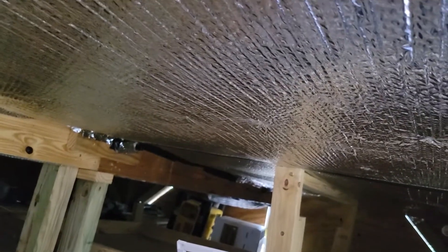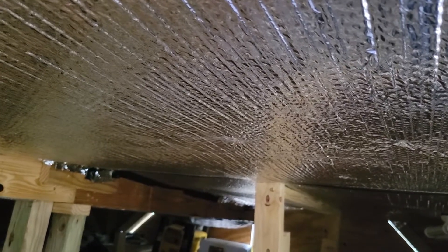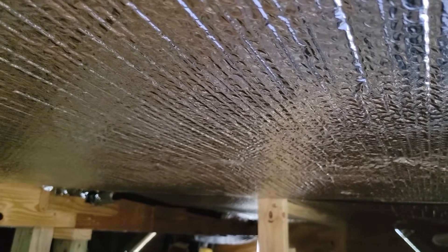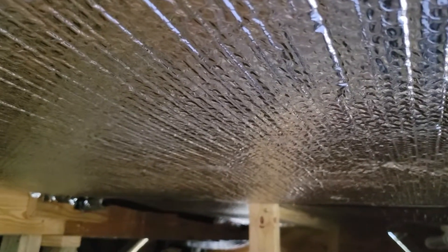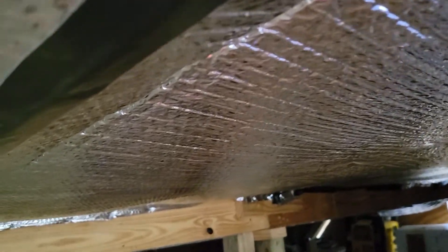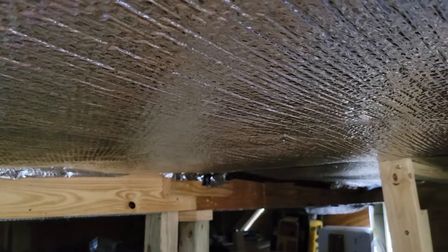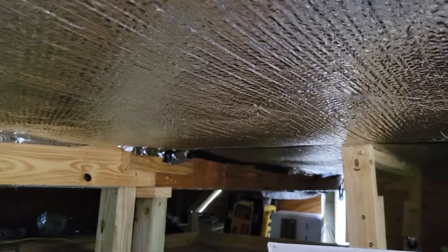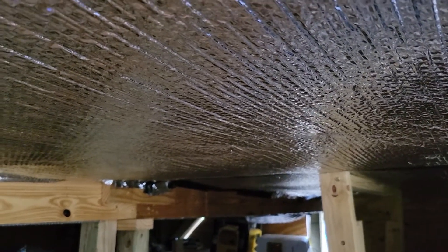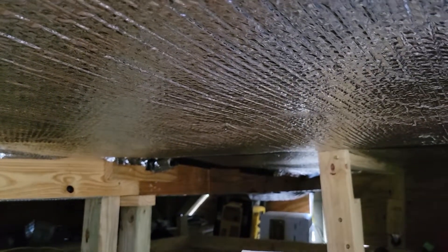I got this foil board covering up the rock wall with one inch closed cell foam, and I put it all underneath the plywood flooring and all around the rim joist, and I taped up the seams. It seems like it's really working — it's only been just a few days and I can tell a big difference already. I'm gonna say it probably cut my heat bill in half, maybe, but definitely a big difference.